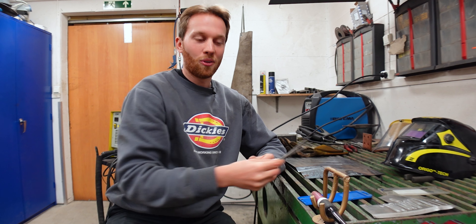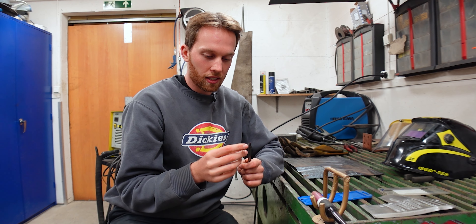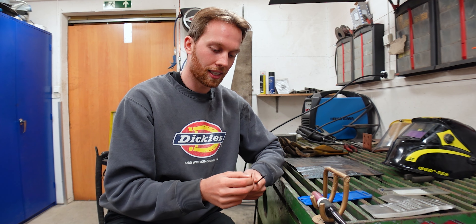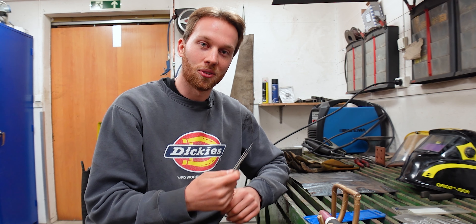Overall I'm pretty happy with the first exercise. Let's continue with the second one and try to make continuous welds while keeping the weld puddle the same width. But first I need to resharpen these tungstens. After a while they got dirty and the arc started to jump all over the place before finding the center. I'm not sure if I was too close to the metal — some spatter came up and got stuck on the tungsten. If you know anything about that, let me know in the comments.